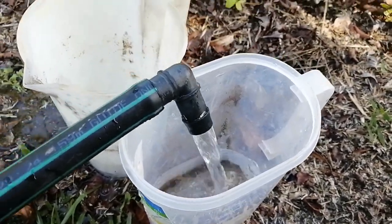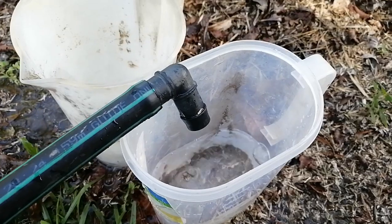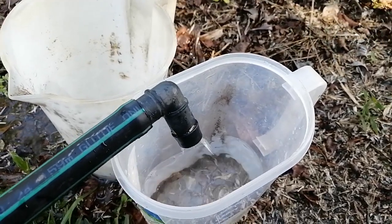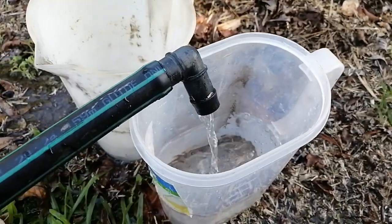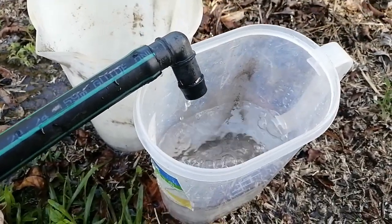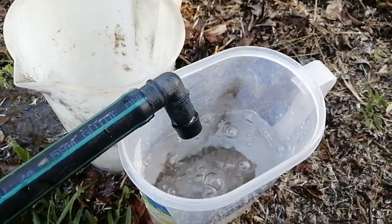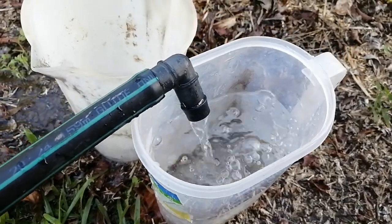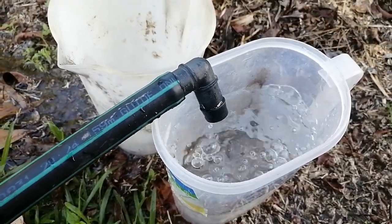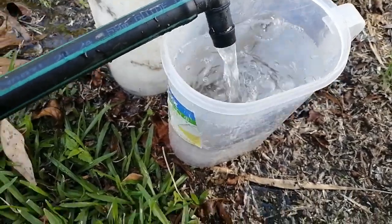The output for the pump — the Bunyip pump TA-13 with a 48mm piston in Liverpool Creek around Silkwood — this is the output. It works out to be around 4,300 litres a day at the moment, a bit over 4,000 litres. Not bad for a 400mm fall.